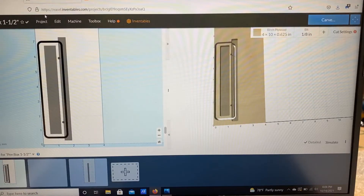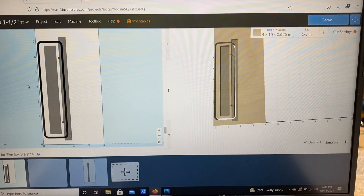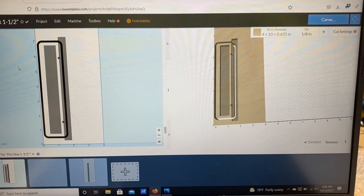Here's what I came up with. Over on the left side, this black outline is the actual outline of the case itself — I made mine an inch and a half wide by six and a half inches long. Most of the pens or pencils I turn are about five to five and a quarter inches, so that's plenty long. This box is basically going to be three different tool paths: the black one for the outline, the center one is a cove bit which creates a shallow recess for the pen or pencil to sit in, and this outside one is a 90-degree V-bit that's going to chamfer the back edge of the top and the back edge of the bottom.